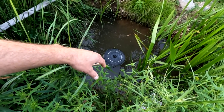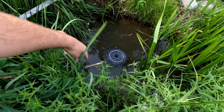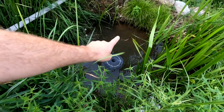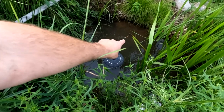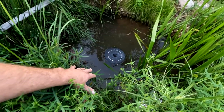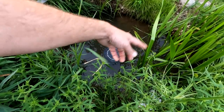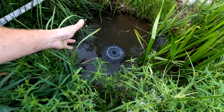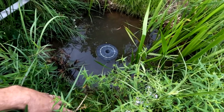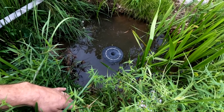Another argument for doing that is the combination of the gypsum and the clay almost forms like a kind of cement in the bed of the pond. So anywhere at the base of the pond where the water is seeping into the ground, all those clay-gypsum particles sort of plug that up. I noticed after I did all of that — it's not like it's surrounded in concrete — but it just held water way, way better. The water does not seep out of this thing. We get a good rain, it fills up and then it just slowly, slowly evaporates.